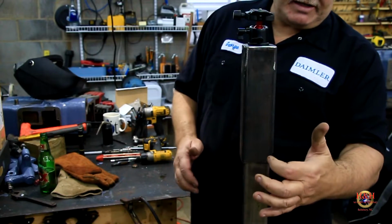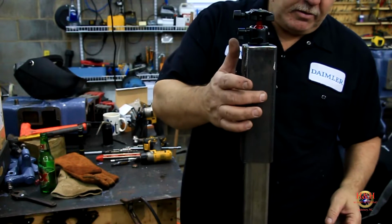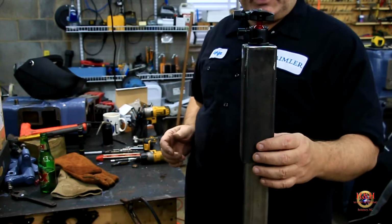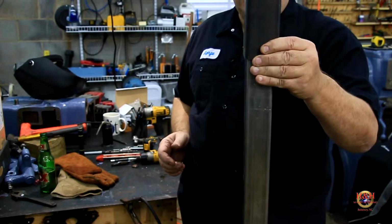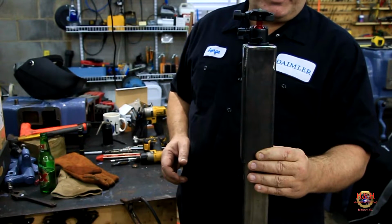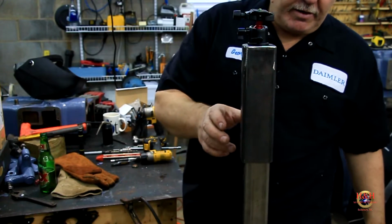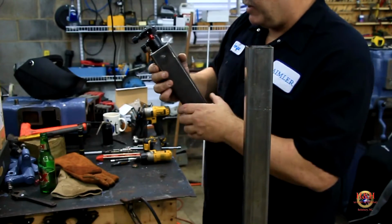So next thing, we're gonna tap a couple holes here, maybe 2 at the bottom, 1 up here, or maybe, might as well do 4, just in case. I get it up kind of high, you know, just to have a little extra right there. And I'll just put 1/4, tap that 1/4 just like I did the top, and then we'll carry on from there. So let's go back over here to the table here.